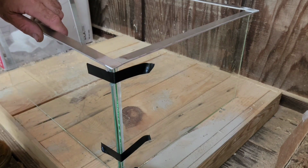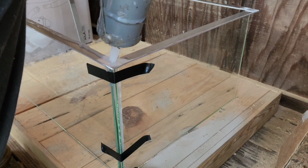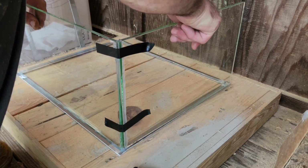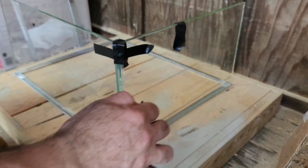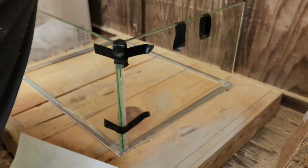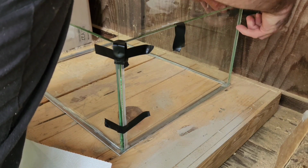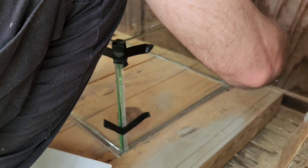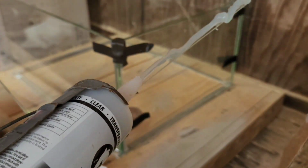Now we're going to lay out the frame to help support the glass and prevent crackage. And square everything up. Getting our tape ready for the next piece. A little bit of that caulk adhesive on the side, and presto. By the way, this is a total failure. I'm going to tell you the truth. This tape doesn't hold very well, and everything's sliding all over the place, and the glass is just a little bit short. So watch your measurements.